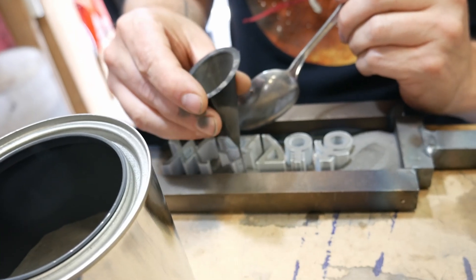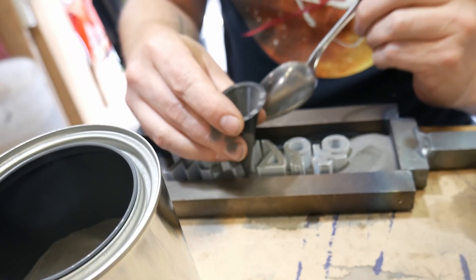Sounds simple enough — let's get to work. Those two different powdered metals, the one with nickel and the one without, need to be separated. They get separated by a vase-shaped 3D print done in PLA. The PLA when it burns creates carbon, and if anything it helps with the forge welding happening here. It's not Damascus exactly — Dave came up with the best term for it: it's a 3D canister forge weld process. This allows you to create really amazing differential colors in a blade. Once everything is in place and packed tight, it's time to seal up the mold.